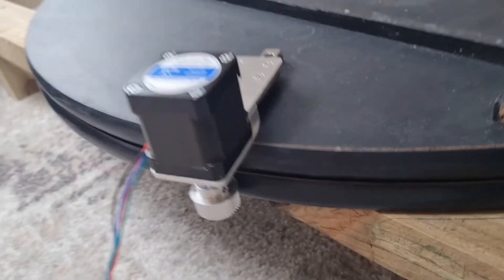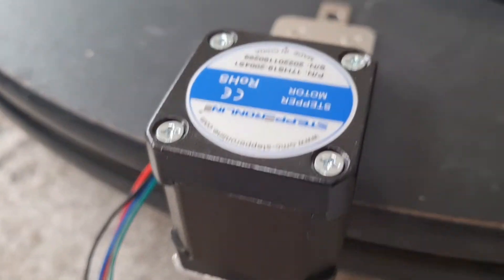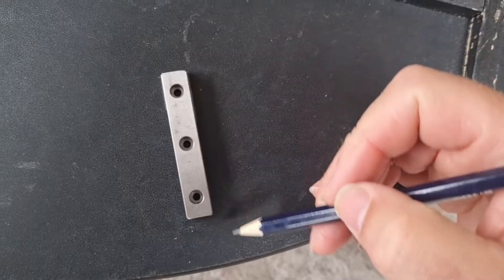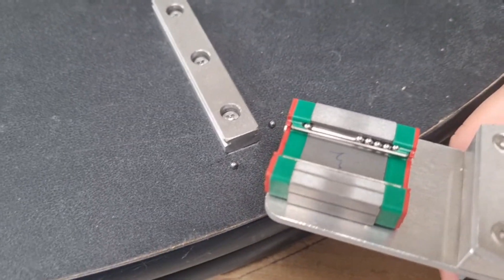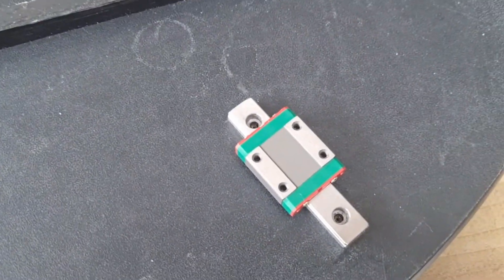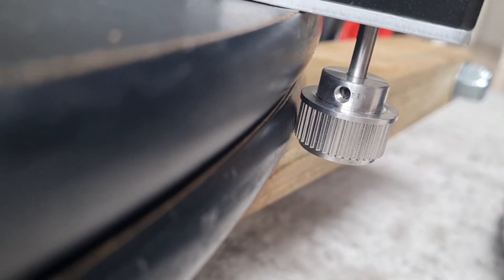The first thing I did was install the azimuth motor. I didn't really have any idea where I wanted to put it initially — you'll see as the build goes on that I actually move it to the side, for a reason I'll explain later. It's quite simple to mark out: you literally just put it down onto the edge of your scope and drill three holes. Be very careful when you take the slider off because the ball bearings will pop out. The solution is just don't take it off — you can mark out where you want to drill by leaving it on, then attach the slider onto the bracket and fix the motor onto the scope. It's important you get a good fit and that the toothed drive wheel sits pretty much in the center of the bottom board; I had to loosen the grub screws and adjust it up and down until I got it right.